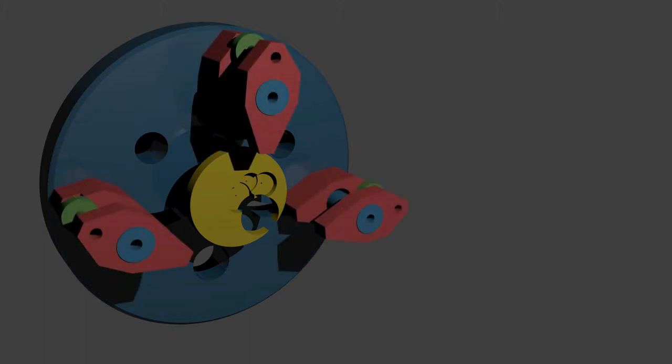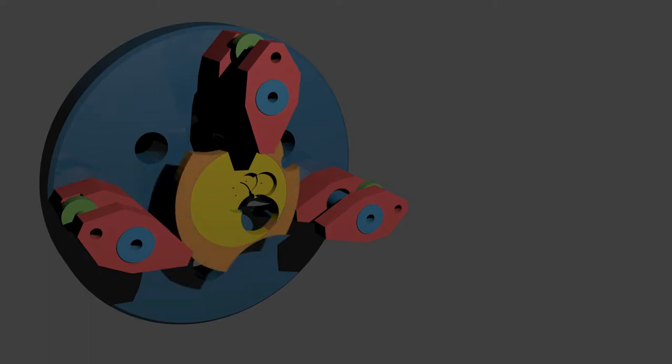To ensure that the plate can be held without damaging any of the features, the stock is cut to a shape which includes flanges to clamp the part. The flanges are shown in a slightly different colour here to highlight the shape, but are part of the single piece of stock cut out to make the watch part.